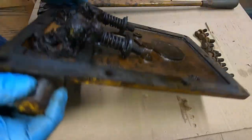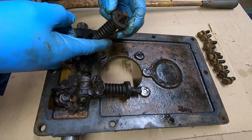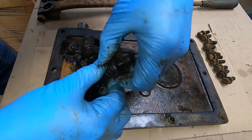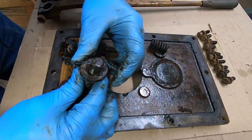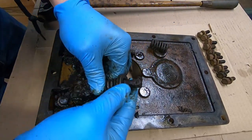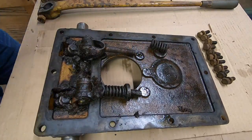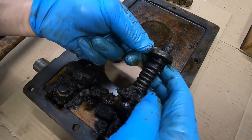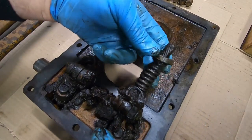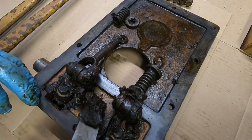Alright, lots of cleanup to do, but we might as well start with getting some of these pieces off. We still have steering clutch actuator pull rods, heavy washer there, kind of a return spring — one of those on each side. Might as well pull them off. That one's kind of stuck somehow. Trying to figure out what's holding it. It's so greasy it's hard to even get a look at it. I think there might be a burr on here. Yeah, we got a high spot right there. Looking at this, we've got a broken coil on the spring anyway, and this takes a little bit of a dive out that way. That's kind of common to see on these. We'll get into that later, but I'm going to have to get that cleaned up a little bit, deburr it. We'll worry about that then — just proceed with getting some of this grease out of here.